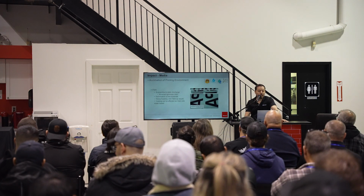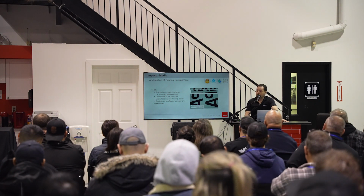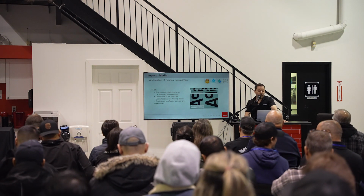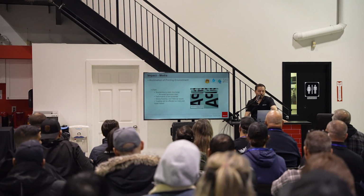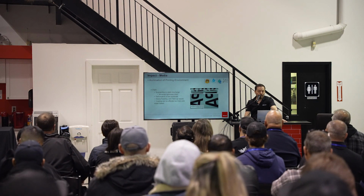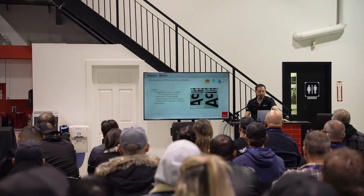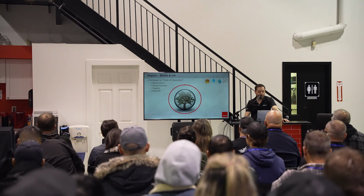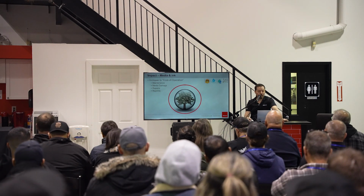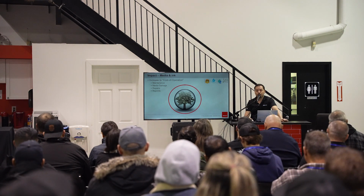All right, just to give you a little idea, so your film is susceptible to static discharge. You can see the picture, you can see kind of some streaks happening, some overspray, sorry. So it can deform the substrate, cause media feeding issues and take-up issues, skew the print. The coating may be affected on your film since it's typically water-based. All right, and the impact to your media and ink, right? So it's going to be more maintenance, media damage, repairs, reprints, and it's all a cost to you.